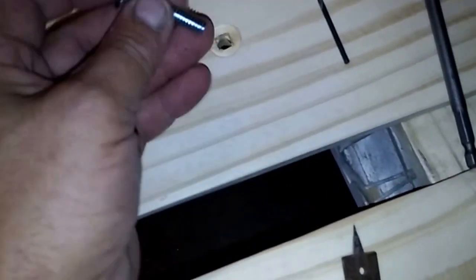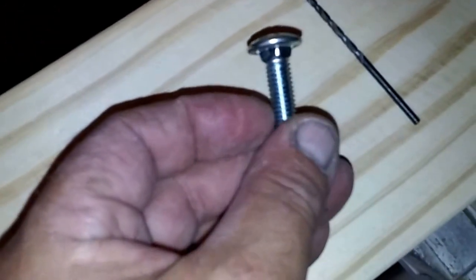The paddle bit I used is the same size as the bolt head. You stick your bolt down in there, and I used another block of wood on top and smacked the bolt down, because the square area on top of the bolt is what makes the square mark that holds it in place while you tighten it from the back.